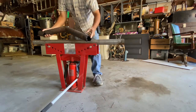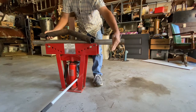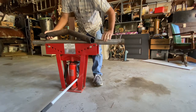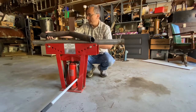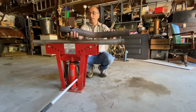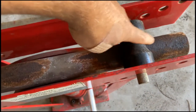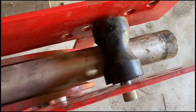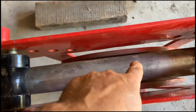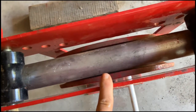The end of this was rusted off, so we're going to leave at least six to eight inches on it to make sure we have a tailpipe that clears the back of the bus. That's what we're going to try and recreate. We got the pipe in there. We're going to leave a little bit on this end, not bent, to slide into the other part of the pipe on the bus. Then we'll have to spin it again to create that other bend. We're not going to get the exact bend from the original.